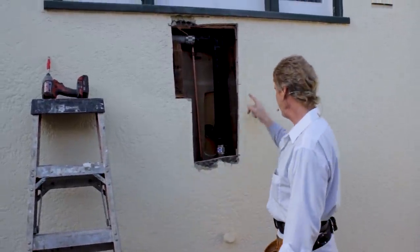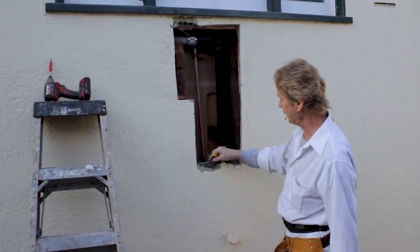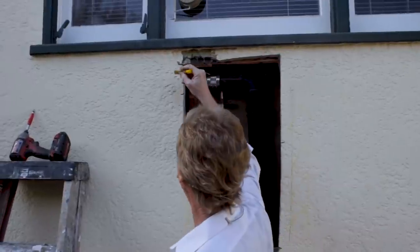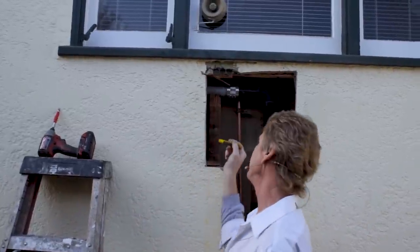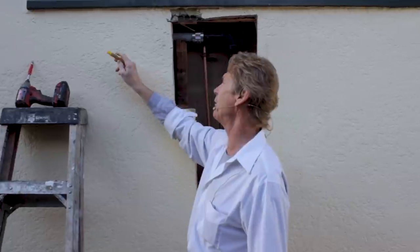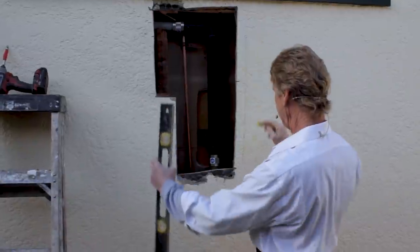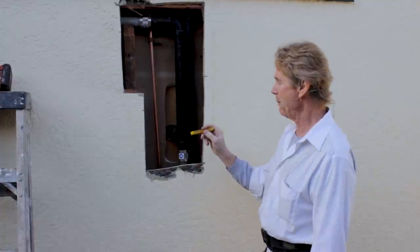What you need to do is you can't just break out a little bit of stucco — you should be on a stud so you can use the existing paper and tie it in. Waterproofing the perimeter is way more important than anything else. After Lou breaks this out, he'll leave as much paper as possible. The paper looks in pretty good condition, but where the stud was cut to put the pipe in, we've got to break back to get some decent paper. With a stud right here it's easy — Lou's going to break this out while we go do something else.